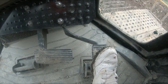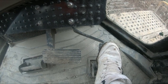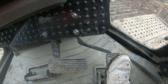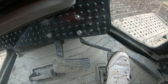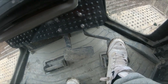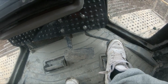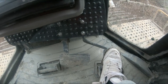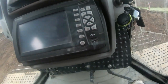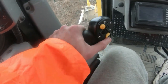That's your foot brake and that's your deaccelerator. It's called a deaccelerator because in a dozer you don't accelerate — you deaccelerate. With your foot to the floor you're at no revs; with your foot coming off you're at full revs. The reason being is when you're on rough terrain and you're trying to trim, it's easier to have your foot hovering off the pedal than trying to push down to accelerate — otherwise you just get a kangaroo effect.